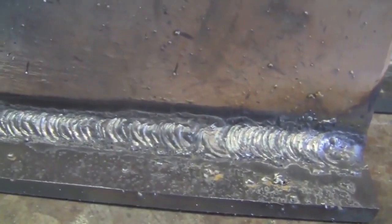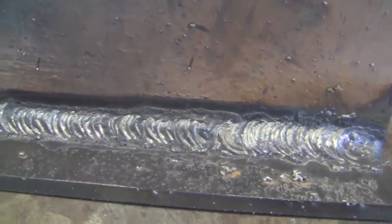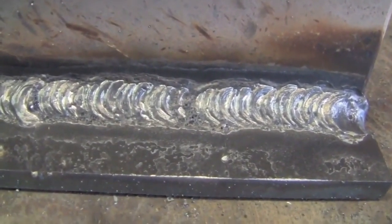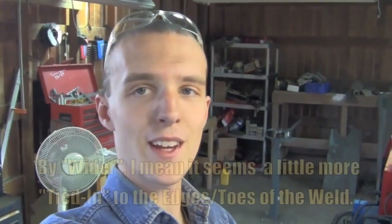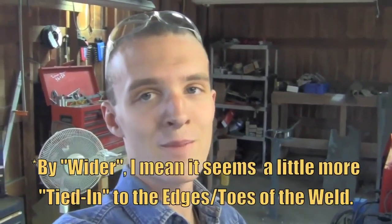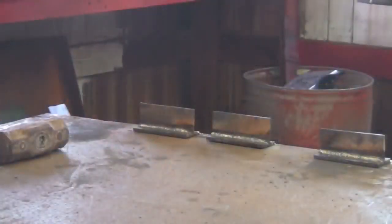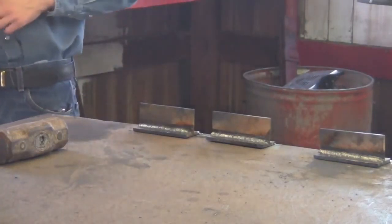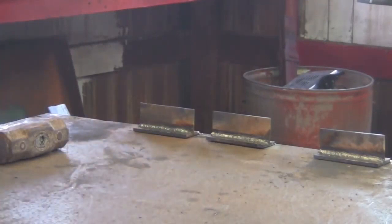Let's take a look here. In this corner we've got the whip and pause, and in this corner we have the circling motion thing. For me, I get better looking welds with the circling motion, but it feels like the whip and pause gets a little bit more penetration — digs in a little more. But the circling motion gives you a slightly wider bead than the whip and pause. Which one do I think is going to win? I honestly don't know. There's only one way to find out. The first two we're going to test are the whip and pause welds.